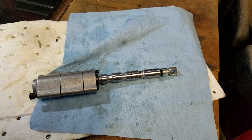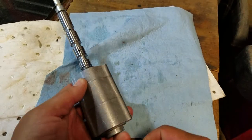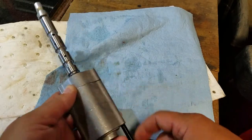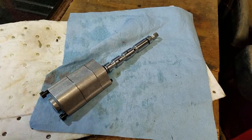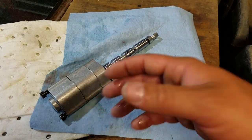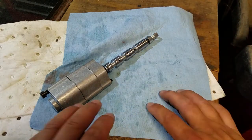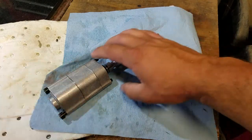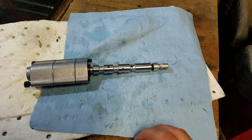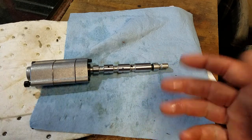I was informed that no, they don't have an off-the-shelf kit available. They also couldn't provide o-ring numbers. The only thing you can hope for is that these are just stock o-rings, so you can grab an o-ring kit and match them up by measuring. It would have been nice if they'd just said 'this is a number 322' or some stock size.